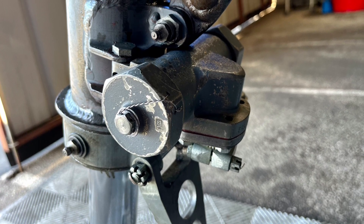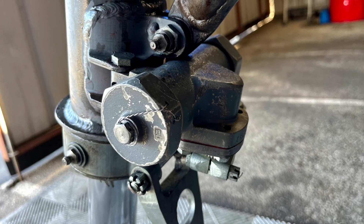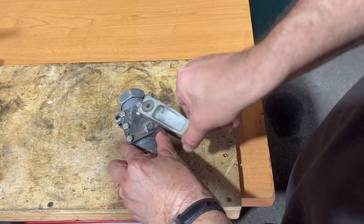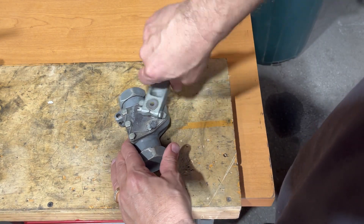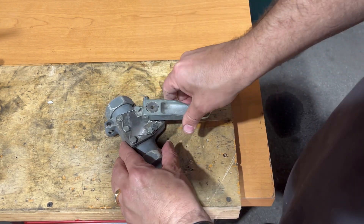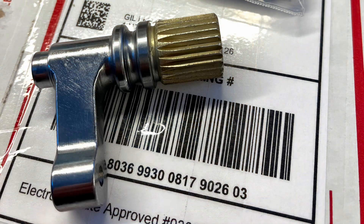So take a look at it, disconnect the lever arm from it and wiggle it back and forth and see if it's moving easily like this. If it's moving this easily, then either it's completely out of liquid, which is going to be pretty unusual, or the arm inside has in fact sheared.